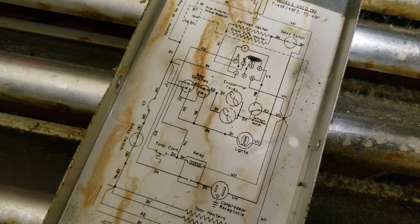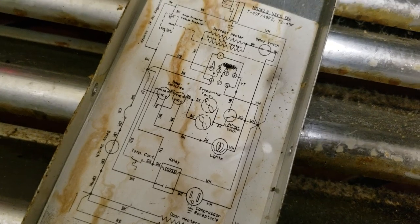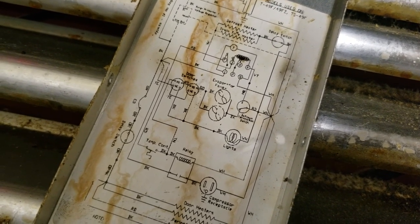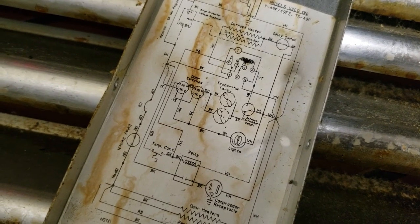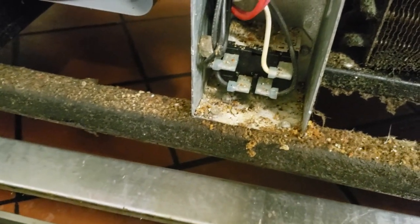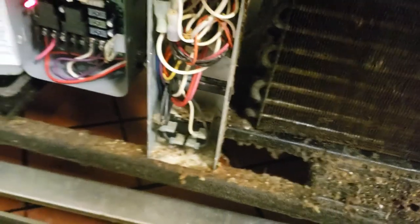When the condenser's not hot, like it was — I mean, granted the evaporator's not running — it kind of led me down that rabbit trail. But we'll go ahead and get that bypassed, get them running, re-check the suction pressure and stuff when we get done, see how we're doing. Another issue you can have with these is those relays there can act up and not bring the system on, but obviously since the compressor is running, that's not it.